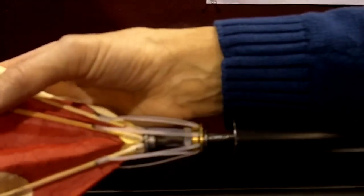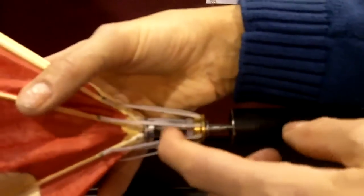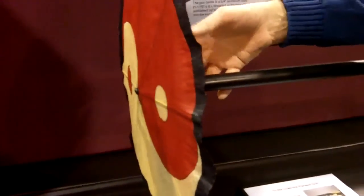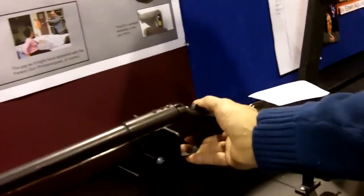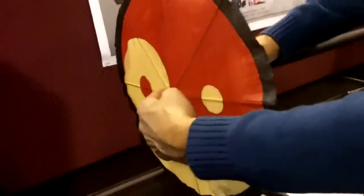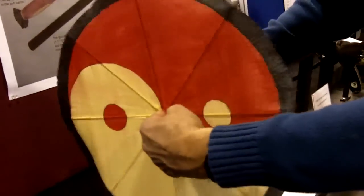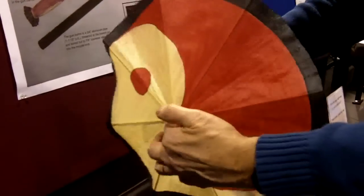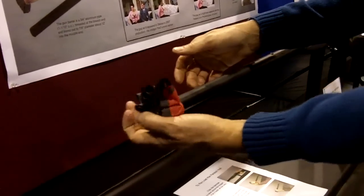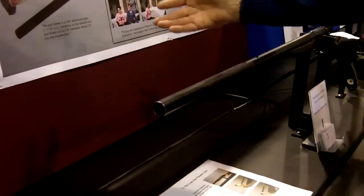The other end is held between a little sandwich system of machine brass discs and a special three-eighths inch bolt and nut that clamps them together and keeps them secure. It's pulled open by the spring that you see compressed right now. As the spring pushes, it pulls open the parasol. When we're ready to reload it, we cock the hammer — that relieves the pressure in the cylinder — come over and press in the center until it starts to fold up, gather it up in your hands and push it in. Now you're ready to fire.